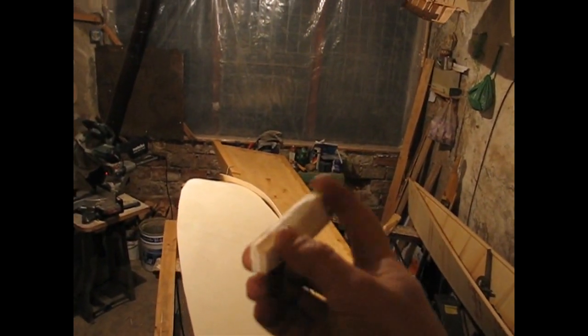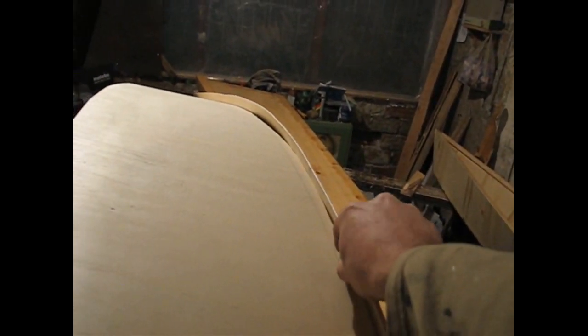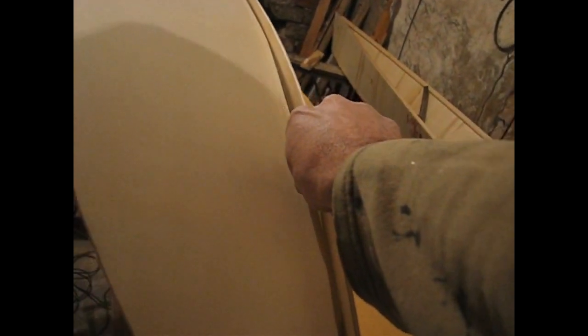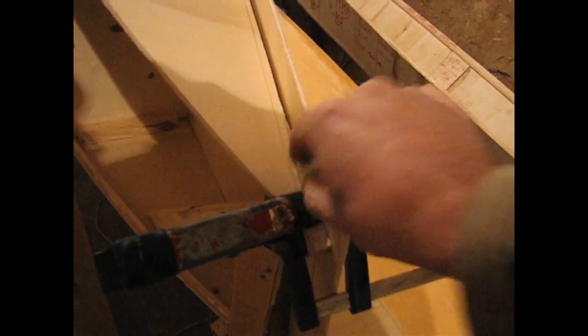Such a template is kind of risky to make only one half — draw it onto the plywood both sides, because if you mess up on your connection and one side comes out wrong, you'll throw away the whole piece of ply. What I'm saying is: make one half, test it, and if it's all good, copy it onto another piece of cardboard. Put them in place, glue them in somehow, then connect them. That's our panel in place. Scribing the bottom end cut line — looking good.